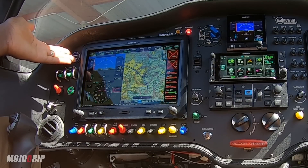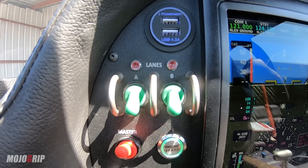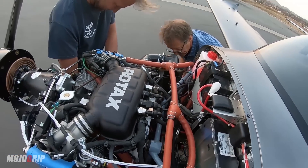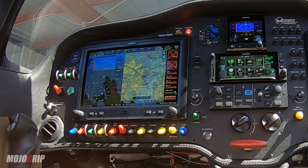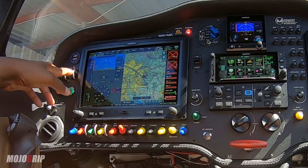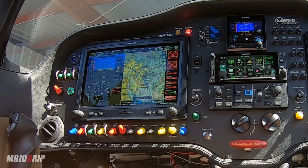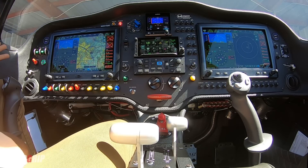You've got your USB ports and you have two lanes. Now before I explain what the lanes are, these are what's connected to your engine. The Rotax 915 itself is a very robust and redundant system. This plane has two generators and three batteries — that's how redundant it is. Two generators work with lanes A and B, and then you have batteries: one main battery and two backup batteries. Think of all three batteries as backups, because generally when the airplane is operating, it's just the generators working and all the batteries are on standby.